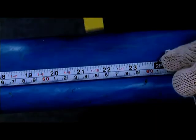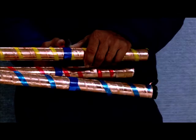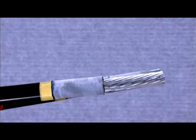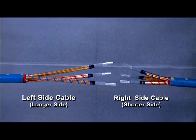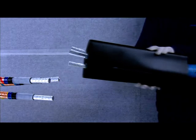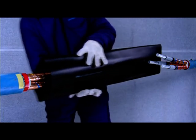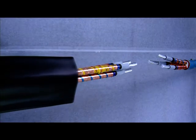From the end of the right side cable, or the shorter side, measure and mark a length of 550 mm on the outer sheath. Carry out similar preparation process for the right side cable as done on the left side. Now both the cables are prepared up to the same stage. Insert one side sleeve onto each cable from the cutting end and move it to the side away from the jointing area. Insert the main heat shrinkable adhesive lined outer jacketing sleeve from the cutting end of the left side cable up to a position where the jointing work will not be disturbed.